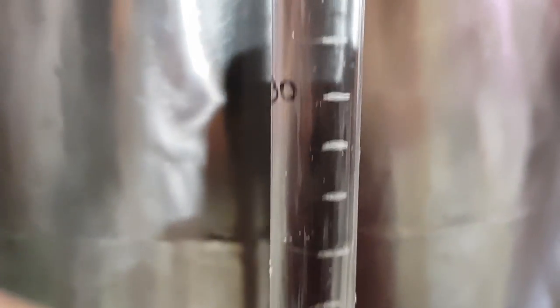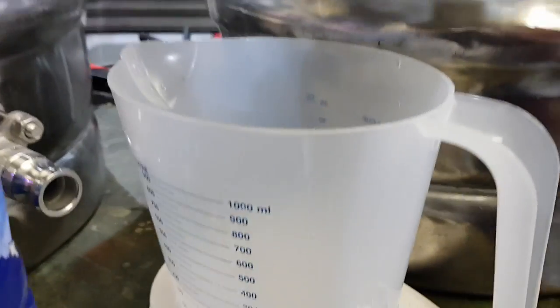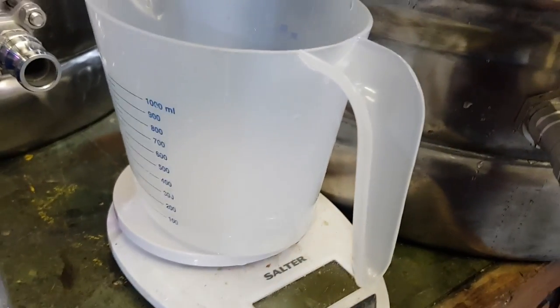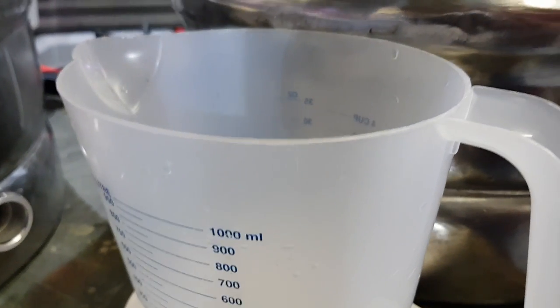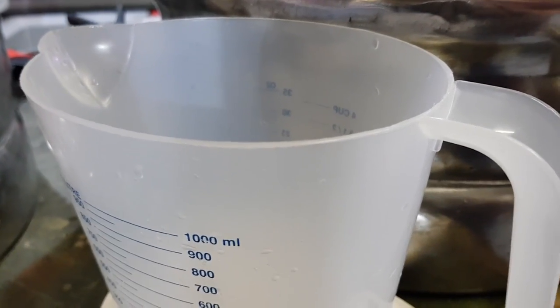A way to have a really boring afternoon - just try calibrating one of these, because it's a pain. And it's actually done by weight - we weighed it on scales, because I don't think any of these jugs are totally accurate. We thought the scale was probably more accurate than the jug. So one kilo is one litre, and the HLT will hold 43 litres.